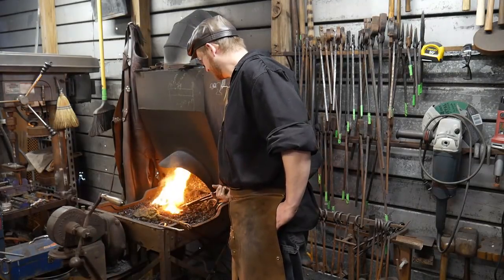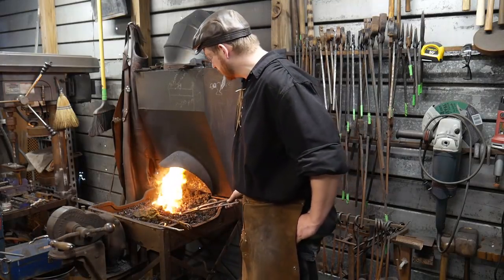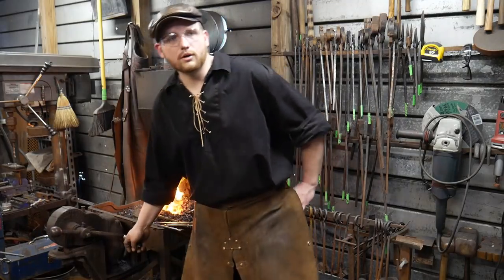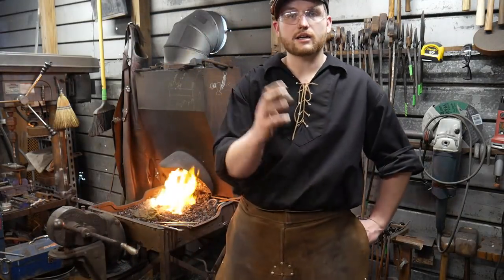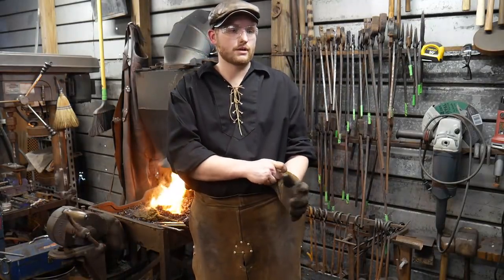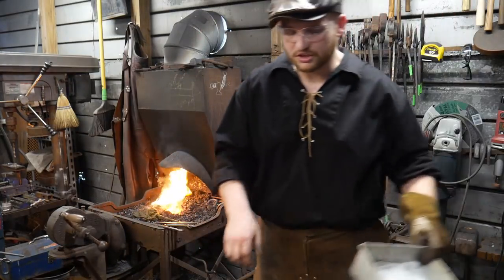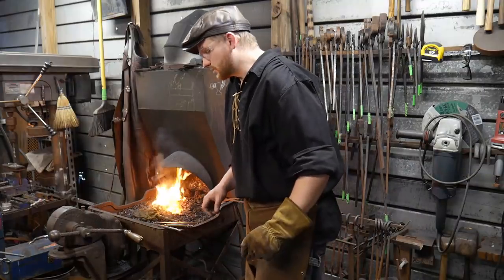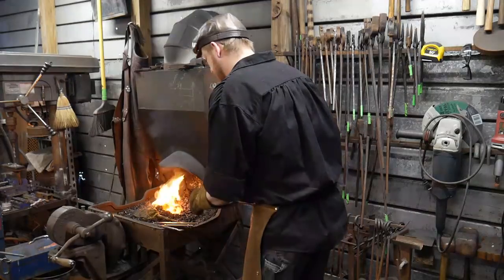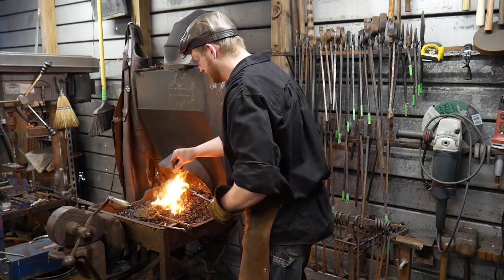Okay. Billy Strong says, is it easier to make smaller links or larger links just starting out? Just starting out, the larger the link, the better, usually. It gives you more time to work the weld joint and get things stuck and welded. When you've been doing it a while, you can weld smaller and smaller links. That's true with any forge welding. It takes more time than you think to get good at it.